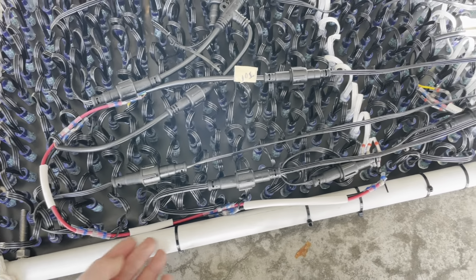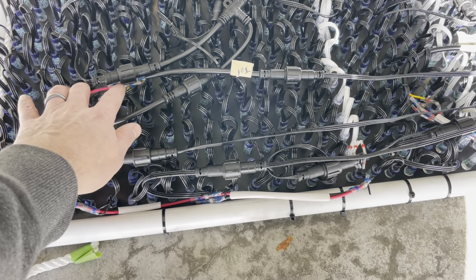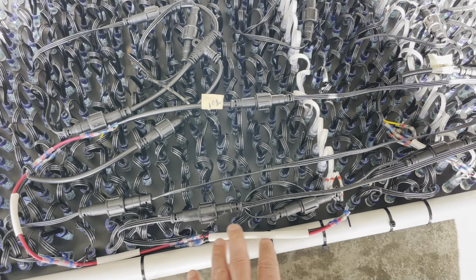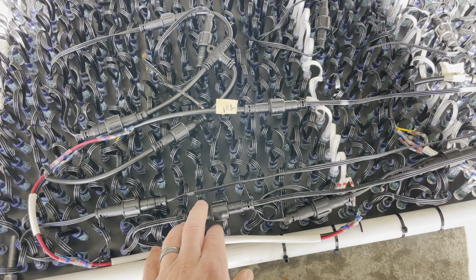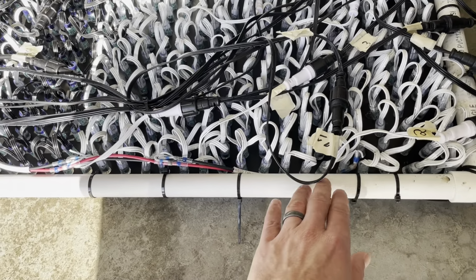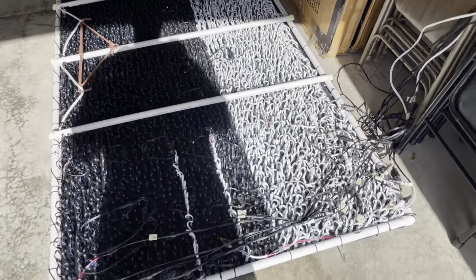So power injection is done by tying. If there's 4 runs on the upper half of the array, I've taken the ends of those 4 runs and tied them into the power injection line. And then I feed the power injection line right here, top, with 12 volt off of the 2 Meanwell LRS 350-12s. So I'm trying to inject at the same point on the upper 4 lines as the signaling and 12 volt coming in on the front of those lines, or the beginning of that sequence. And I do the same on the bottom half, power injecting at the end of the runs as well as being fed by data and power at the beginning of the runs. So that is the array structure.